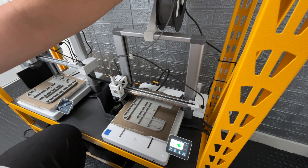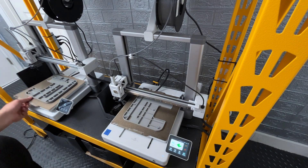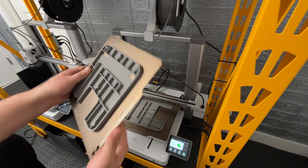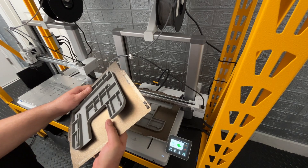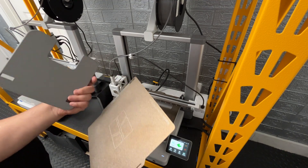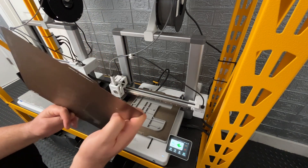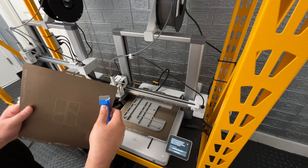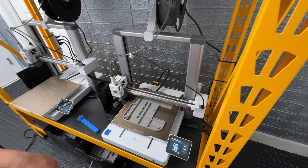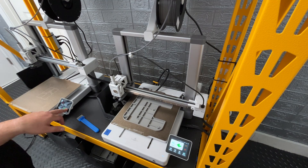With my old Creality printers I used to worry about resuming prints, especially with the S5, but these Bambu A1s just resume perfectly. While that one warms up, I'll take off this finished print. PETG sticks really well to these PEI sheets, especially since I've printed in the same spot so many times — there's almost a ghost image there. A small piece chipped off but it's fine. With the filament loaded, I'll resume that print and move this machine on to the next job: a left plate.